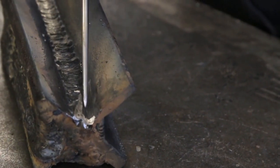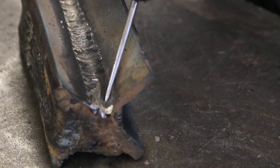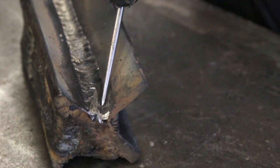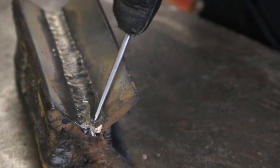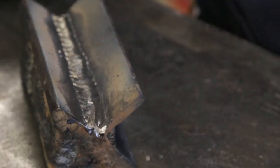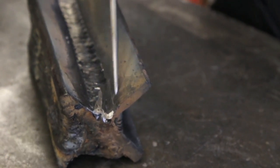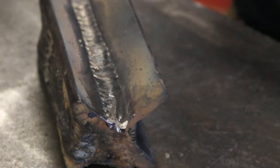I had to get down there pretty low, and even still there's a little more slag. If I was doing this completely correctly for a job I would take all of this out — I can see there's an inclusion in there so low that it has to do with the previous ugly weld. In the interest of time, I'm going to leave it right there and show you how I repair this. Basically I'll weld from here to here and fill it back up equal to the level of everything else so I can then continue running passes.